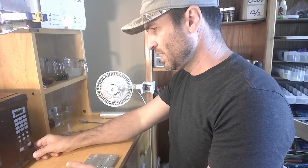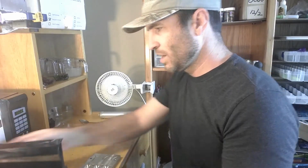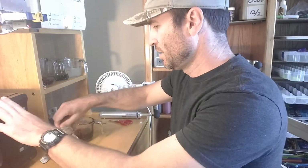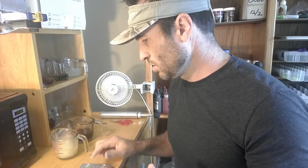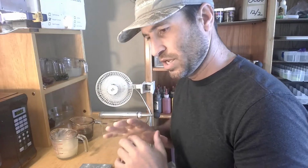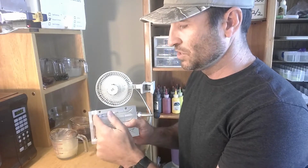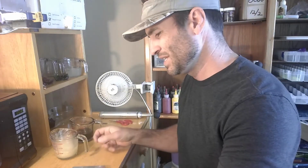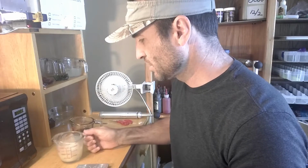So we have this. And I'll tell you why I'm doing a little hand pour and then injecting. Number one, in this particular bait, I like a little more pearl belly, and if you do a dual injector, it'll have 50-50. Also, when you do a dual injector, you'll waste this whole sprue right in here because they get mixed. So if I'm able to get away with a little hand pour and then add the second one, I like to do that so we don't waste.